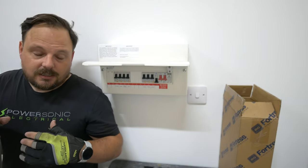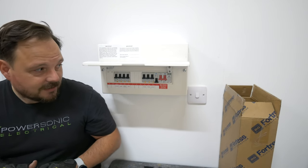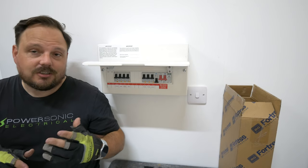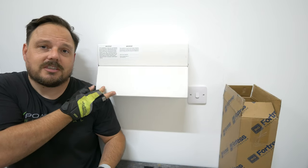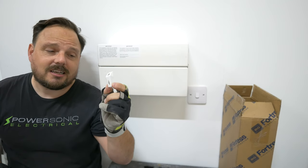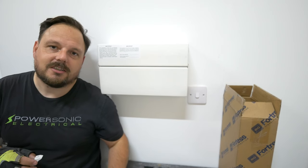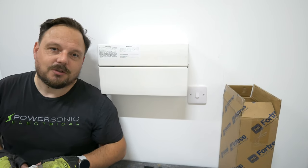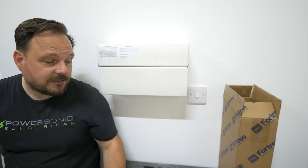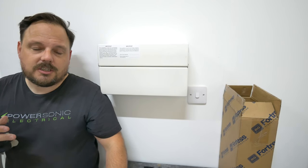So that's the reason I've gone for the approach I have today. The time-lapse is just to try and share a bit of what I do in approaching consumer units and I hope people have found that useful. I'm not one to compare one brand to another - it's just a white box on the wall. The lids now close, which is an improvement - one of the problems I had with BG in the past is that the lids would stay open. They now stay closed but they do supply this little clever clip which keeps the lid open while we're labelling and working on it - that's a nice touch. My own view is to take that clip with you as an installer and keep it in your toolbox, because you can guarantee a client would pop it in there just to leave it open for them to keep resetting breakers. But it is a nice touch and it makes life simpler for us. It's not a bad product at the price it's at - I'm quite happy to install it.